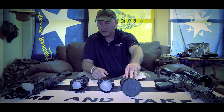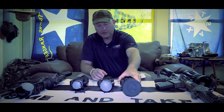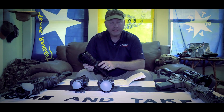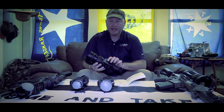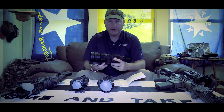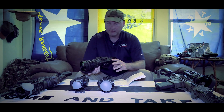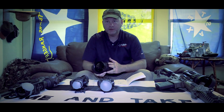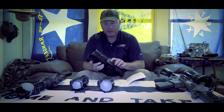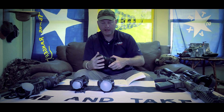The 336 units will go to 4x digital zoom. They also have a manual NUC, which is a mechanical shutter. So you can leave the lens cap off, have the image saturated, and press the up and down arrows — it will trigger a mechanical shutter so you don't have to cover the unit. Most newer thermals have a digital NUC that works okay, and this one has it too. It will automatically do it after so much time to improve your image, but you can also manually trigger a mechanical shutter to improve your image after it's degraded.